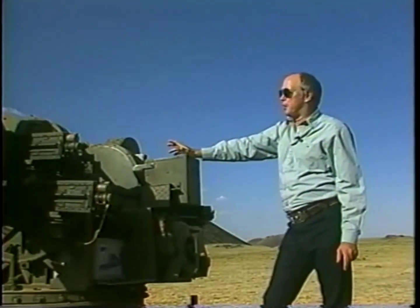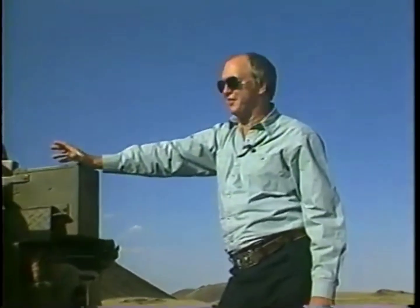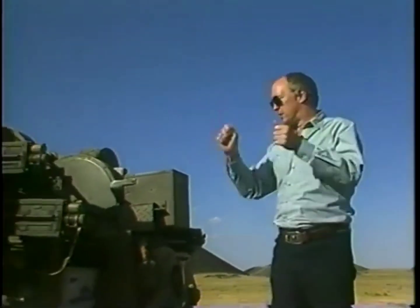The mount was very effective against moving targets in aircraft. Against stationary targets on the ground, as it was used in Korea, the mount was very difficult to use in that no matter where you put the controls, the mount always wanders just a little bit. So instead of sighting in precisely on a target and squeezing off a few rounds, the gunner simply locked down and fired long bursts while doing kind of figure eights through the target.